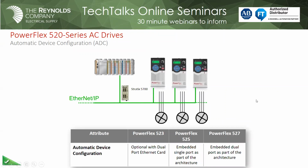So that's step 1. Step 2 is that we now support Firmware Supervisor. When you commission your drive, the PLC will actually go to your laptop and extract the firmware for that drive, and it will store it in non-volatile memory. So when you do have to replace the drive, the PLC will recognize it because it's got its IP address. The controller will then interrogate the drive for the firmware, and it will automatically flash the firmware forwards or backwards to meet your project settings. Then once that's done, it will go ahead and download the parameters into the replacement drive.